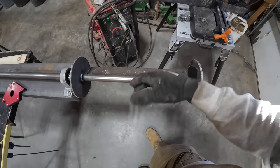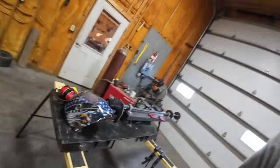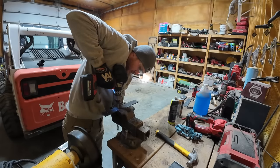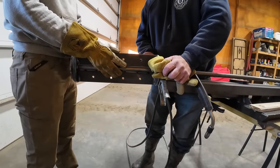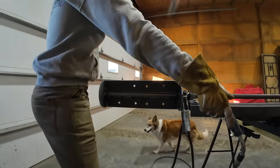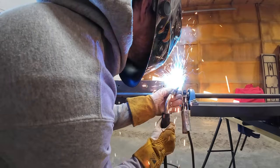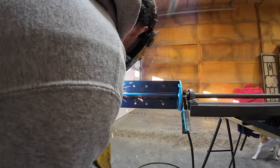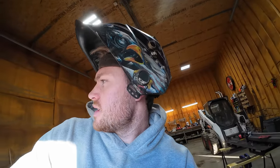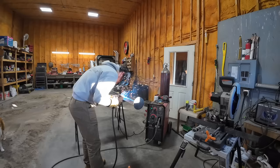We just need to drill a couple more holes, put the other plate in, cut the baler belt, get some hydraulic lines, and that's about it. So Dad's just taking off for Storla Station. He had to pick something up, but I asked while he's headed there to get us some hoses. So we're getting two 5.5 foot long, half inch diameter hoses. Should be plenty.